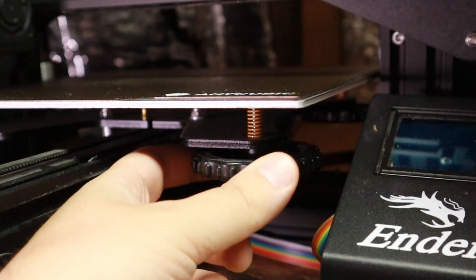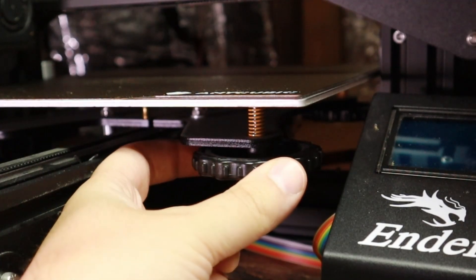Springs! Super cheap but very helpful. The springs your printer comes with are very soft, which means vibrations caused by printing can throw your bed off level. This can even happen in a single print if it's a really long one. Stiffer springs make it so once your bed's level it stays level longer. These are extra important if you don't have auto bed leveling.